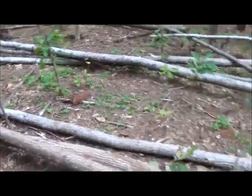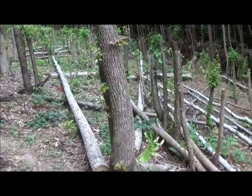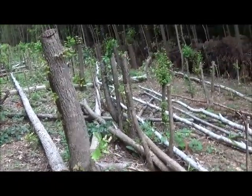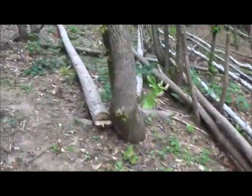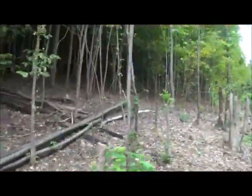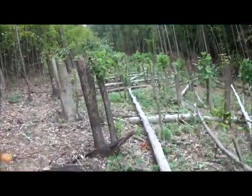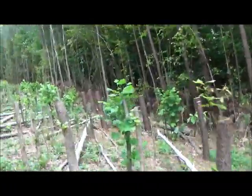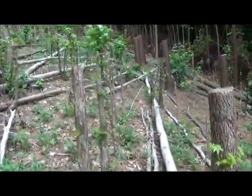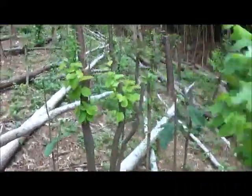Started dragging over logs - they're all scattered. These are hardwoods, these long ones. I wasn't sure what I wanted to do with them. Doing the dozer, I'm going to drag them out of the way, but they're too long and heavy, so I'll be cutting them in half and putting them along this upper edge. I'll be dozing, pushing it out and berming it up as best I can - it'll probably be a lot smaller with the wood in there, and then normal compaction over time will shrink it down a lot.